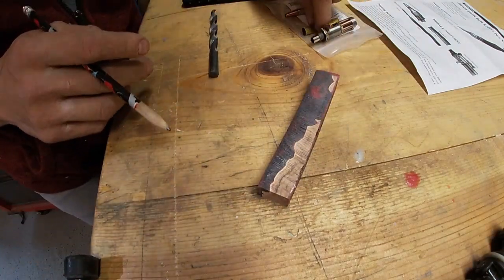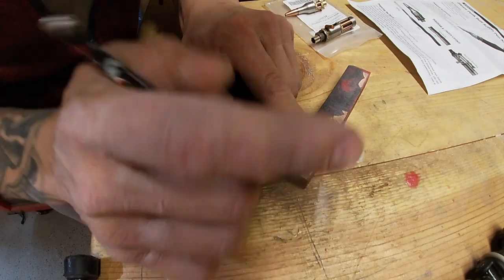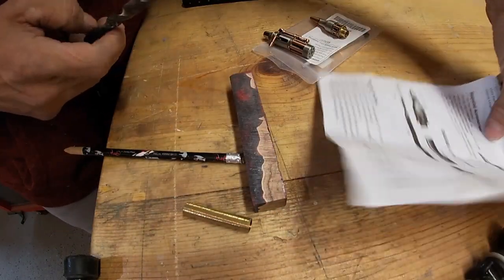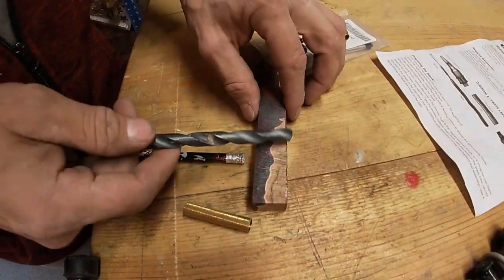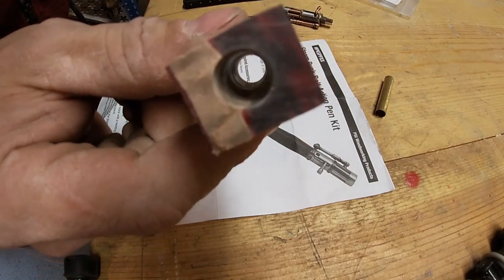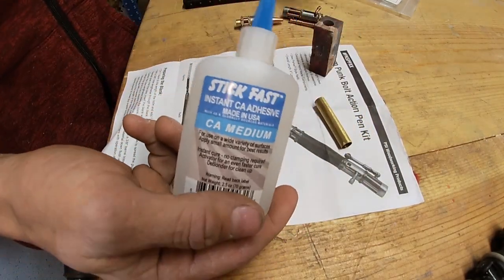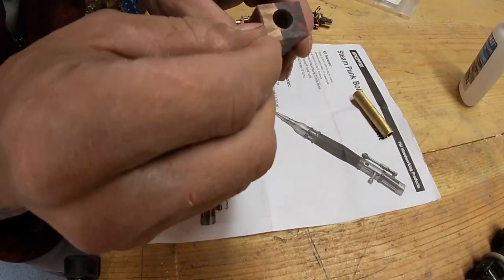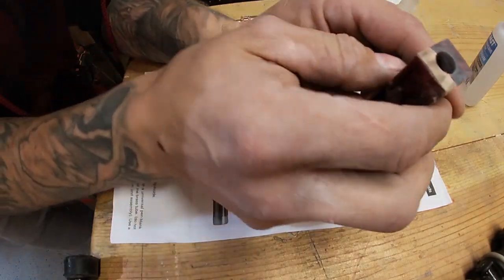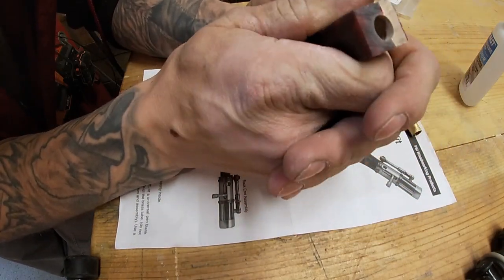Alright, so I've got this blank already cut square. I'm just going to put the tube up here and mark it, leaving a sixteenth on each side. I'll drill a three-eighth hole through there, then get it glued in. I used some Stick Fast CA medium with activator. I'm not going to show you how I drill this out — I just use the drill press holding it by hand. There are clamps to hold blanks in the drill press, you could use a vise, do it by hand, or do it on a lathe.